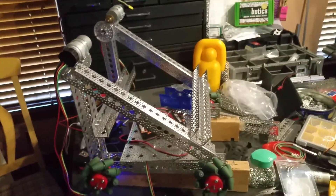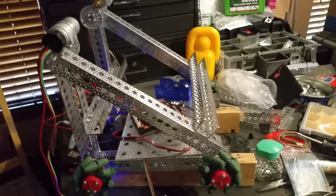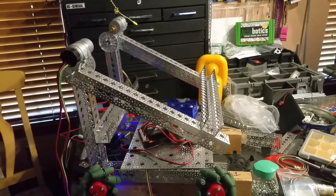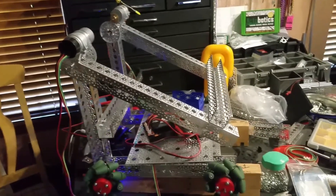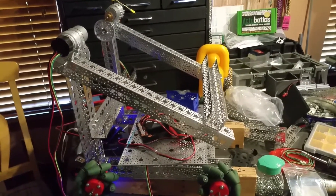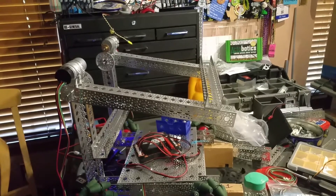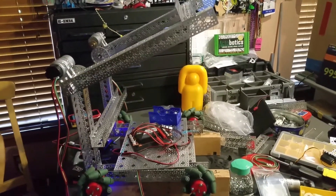Cameron is going to start the op mode and do the first lift, which is intended to get our gripper just up off the ground. With this gear ratio, that's 100 encoder clicks on the 60-to-1 motors. He's put in three stops that we believe are approximate of the 6, 12, and 18 inches that we'd need to lift glyphs into the crypt — then 12, then 18, and then all the way back to zero.